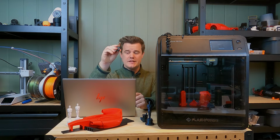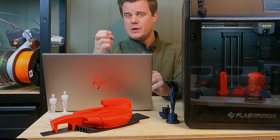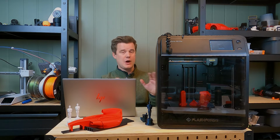Your bed slinger 3D printer, I dare you to do this as good. So, swapping nozzles. For the F1 car, I wanted to swap out the bottom plates to make them a little bit stronger. I wanted to swap out the nozzle using the 0.6mm. This procedure went super fast. I'm actually impressed on how easy it is.